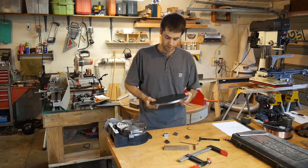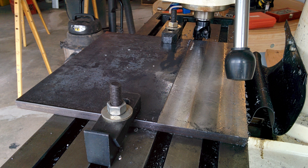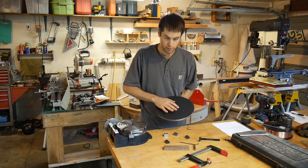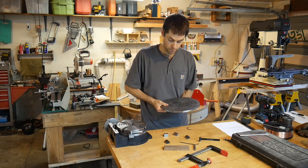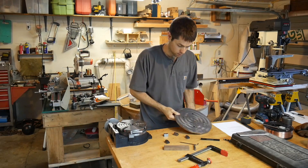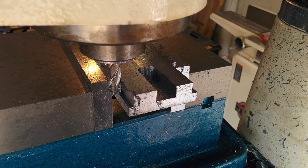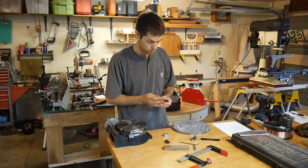I started off trying to make this thing flat — it's just hot roll. I tried to clamp it down with the hump up since it's not perfectly flat, and shim it, but that didn't work very well. So I ended up picking the flattest area and trying to bolt it on. Bolting it on was a little tricky because you need to have your fastener below the surface, and I didn't have a way to counter-bore for the largest screw — the one large enough for standard T-nuts. So I had to make my own T-nuts, set up for a smaller screw which I could counter-bore.